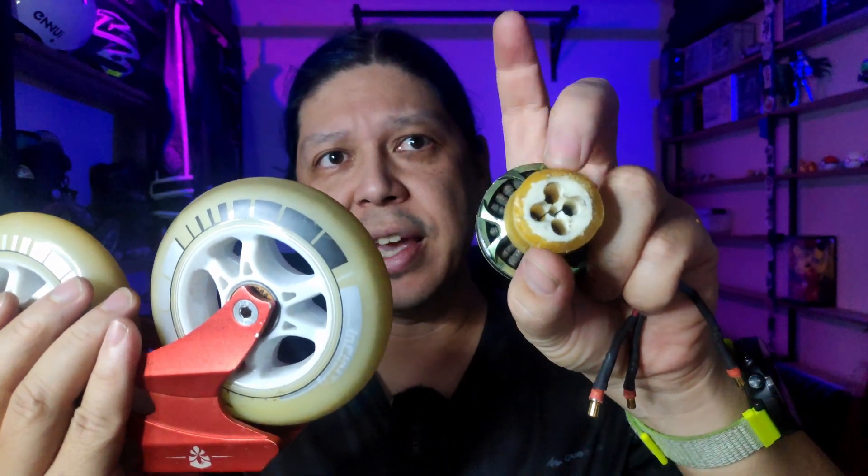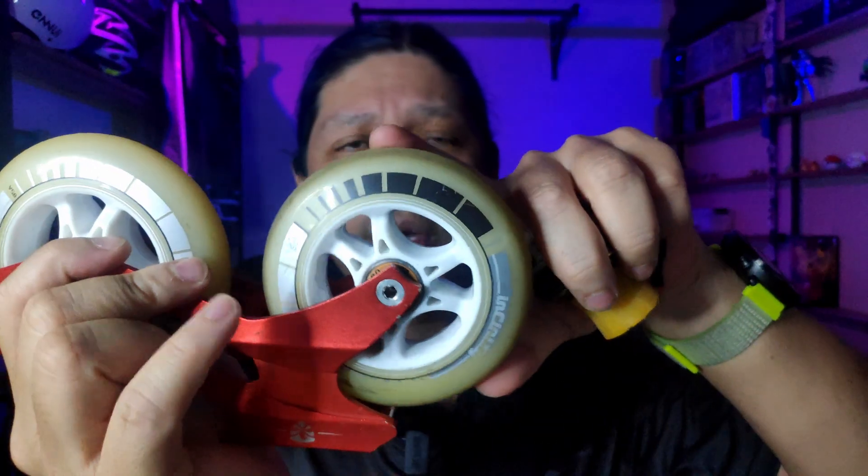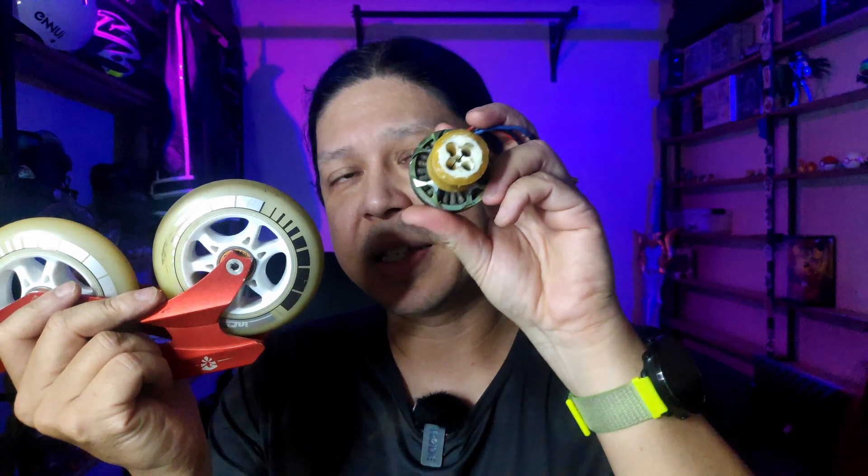The motor itself has a limited amount of torque. How do I better use it — how do I multiply the torque? To multiply the torque, we use gears. Your bicycle, your car — these things have gears to multiply torque. If this drive part has a 25 millimeter diameter and the skate wheel has a 100 millimeter diameter, it means the motor needs to turn four times for the wheel to turn once. So we have to spin the drive part four times as fast, and the more times it turns in comparison, you multiply your torque.